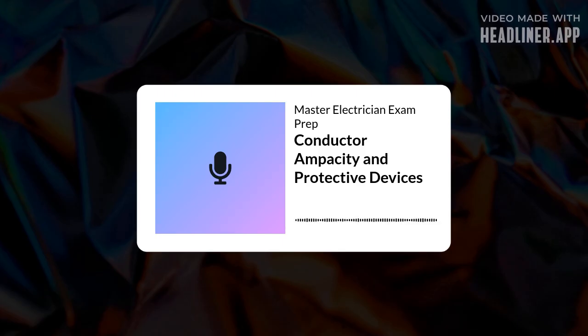Okay, let's talk insulation again. Section 310.104 has the details. Yeah, this section is packed with info on insulated conductors and where you can use them. And this is where it gets interesting, because the insulation type and the conditions, wet, dry, damp, directly determine the conductor's ampacity, especially its maximum operating temperature. Think of it like its thermal speed limit. Thermal speed limit, I like that.